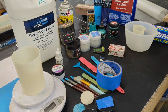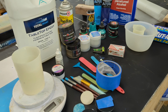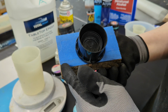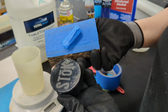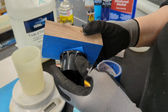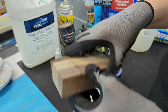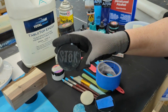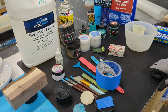Here is a project that I'll be showing and demonstrating with you guys later. It's just going to be an inlay. So what I did is I taped off, and this is another supply, it's just cheap painter's tape. I taped the back off, because I'm going to eventually do an ocean pour, and when I do a pour on this, it's going to drip over the edge, and then eventually it's going to go under here. You're going to have drips here. The tape makes it easier to peel off, and then it doesn't stain the back. But these are the risers I'm talking about. So I just put a little bit of tape on it and just pop it on. And you put it on your table, and as you can see, it's off the table by a couple of inches, and when the resin drips under, it's not going to really stick to your project. So you don't have to put any money into that, just recycle things that you're already using for risers.